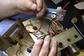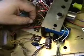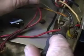In this particular instance, the black wire goes to the chassis ground, right here. This yellow and red striped wire is your ground for the center tap between the two capacitors. You can make the connection here or here — it doesn't really matter. We'll try to do it here; let me heat it up.